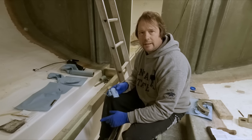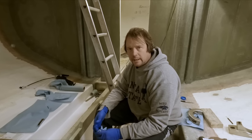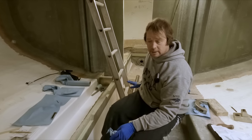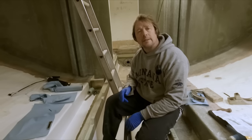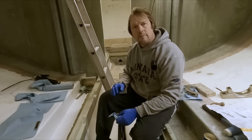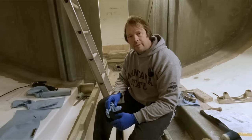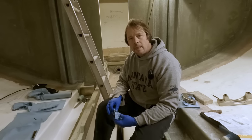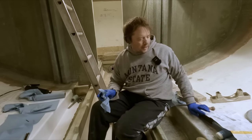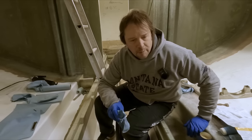It just wanted to get it done and out of the way. But I think the right thing, the prudent thing, is just to wait and get a string pulled and make sure that the stuffing box is where it's supposed to be. And these stern blocks, we can put them in and really avoid even having a lot of shim pack. We should just be able to literally be within 5 or 6 thou, which is perfect. So that was this afternoon's discussion and dilemma, and I'm glad that we took some time to talk it over and come up with that conclusion.